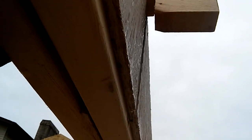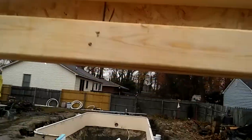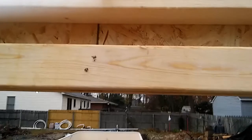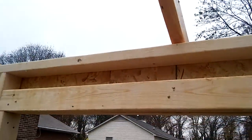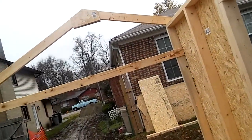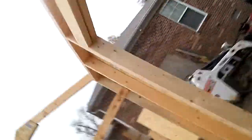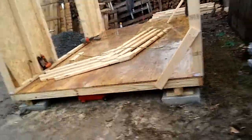That's a big gap but we're about to fix it — no big deal. If I have to, I'll get a ladder up here, hold on, put my knee or foot against that header and push it, then get two nails from underneath and a couple of toenails. One rafter will actually hold and center that. My shed wall is leaning a little — that's really not a big deal — so I just start framing everything.